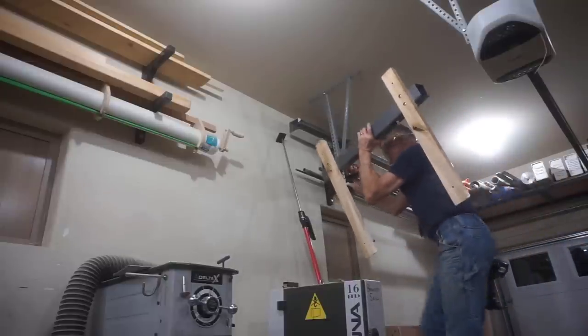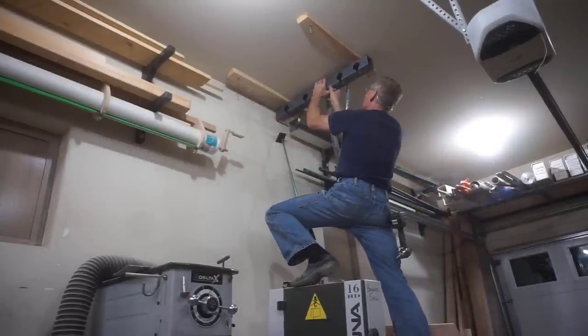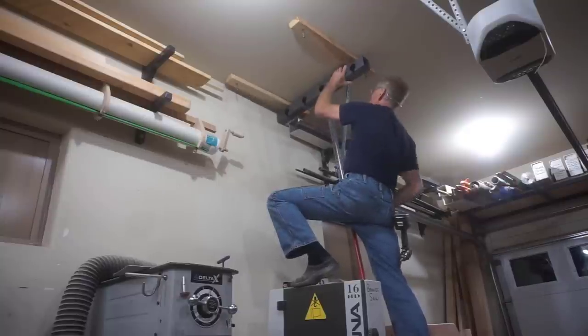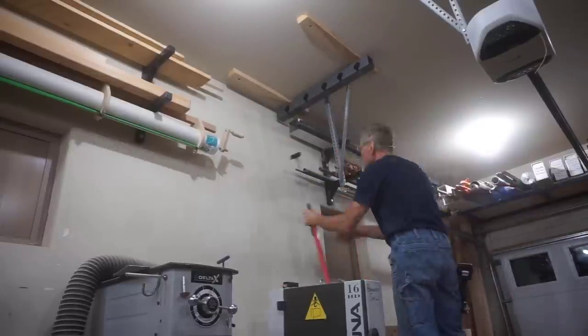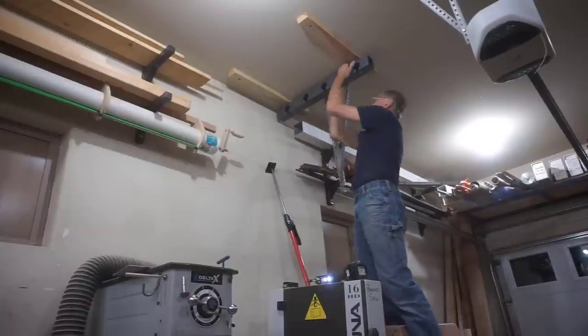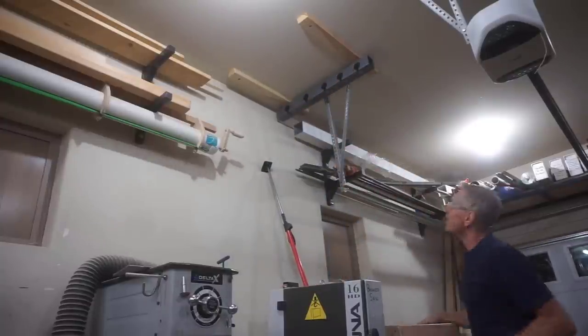I do a carpenter's dance up a stepladder with the hose rack for a partner and, with a bit of gymnastics, work the rack into position and hold it there with a fully extended FastCap third-hand clamp. Once the rack is in position and aligned with location marks made earlier, I simply drive the torx lags home. Doing a lopsided pull-up on the rack after installation tells me this design is plenty strong for everything I'll ever need to hang from it.